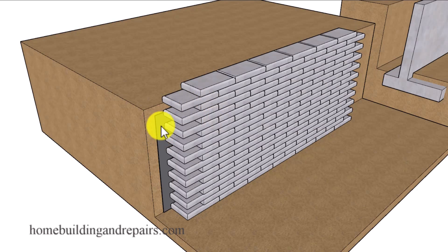If you do use plastic, you have to make sure it's positioned to eliminate all of the moisture coming through, not just some of it. The moisture that settles on the ground in front of the retaining wall can soak up into the lower section. Moisture behind the top can go around if the barrier isn't tall enough. Trapping moisture behind the retaining wall isn't a good idea either — it could increase the force behind the wall and cause it to fail.